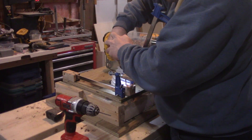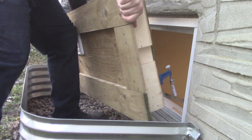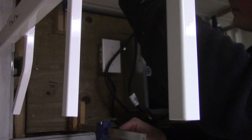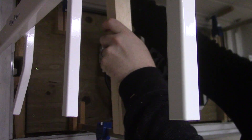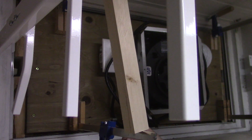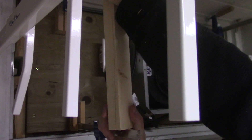Then it's time to install my clamp mounts in each corner — at this point the unit is pretty much finished. The next day I popped the windows out of their frame and put the unit into place. From inside I noticed that my clamp mounts don't work quite as well as intended and they just tilt away from the wall as I tighten them. My quick fix was to put a scrap piece of wood between the two opposing arms to hold them into place, which put the necessary opposing force against the clamps. It's not the best solution but it's what I came up with. Off camera, since I could feel a fairly decent draft coming past the unit, I sealed up the perimeter and any joins in the plywood with some caulking.